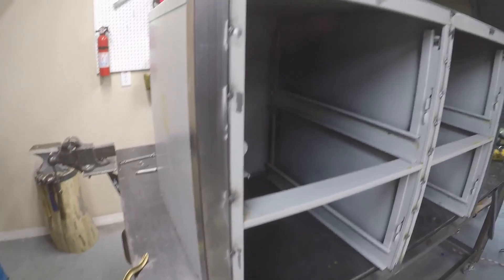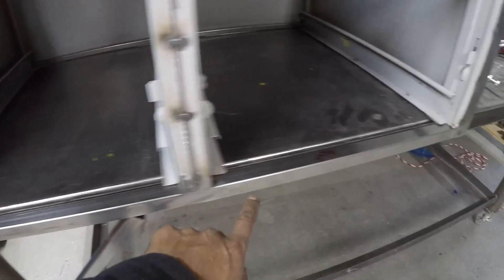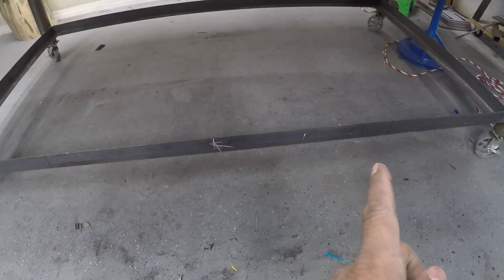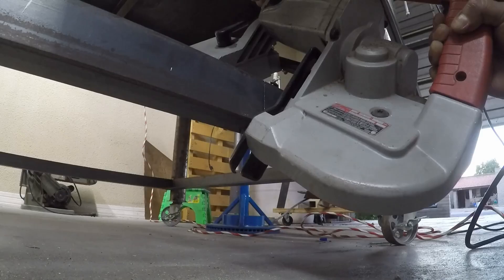Here I have finished putting them together with only pure welding points, because it is very thin. I also reinforced it here below, and everything here is also reinforced. Here below I have also marked the center of the door — I am going to cut that angle so I can put it in the holes.